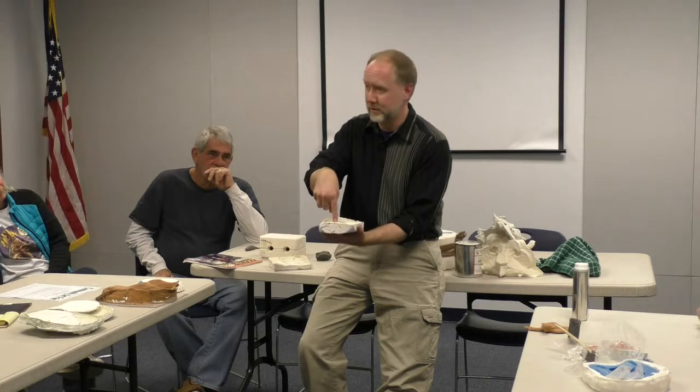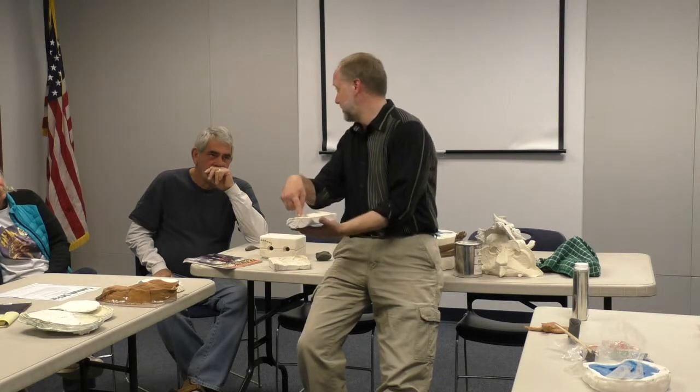Okay, so you take your wax sculpture and put it in another mold, called a waste mold this time. It is meant to be destroyed. So you put plaster all around your sculpture, then heat it up in a kiln till all the wax melts out. Inside you've got a hole the shape of your sculpture. Flip it over, pour molten bronze in before that mold cools down, break off the mold, and now you've got a bronze copy.